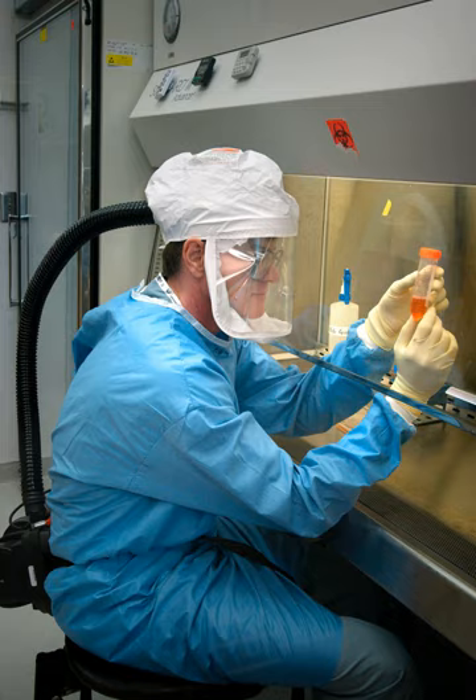This is complicated since the smoke split, demarking the rear of the cabinet, is an invisible line that extends the width of the cabinet approximately 10 to 14 inches from the front grill and drifts as the internal HEPA filters load with particulate. The type B2 cabinet, also known as a total exhaust BSC, is expensive to operate because no air is recirculated within. This type is mainly found in applications such as toxicology laboratories, where the ability to safely use hazardous chemistry is important. Additionally, there is the risk that contaminated air would flow into the laboratory if the exhaust system for a type B1 or B2 cabinet were to fail.